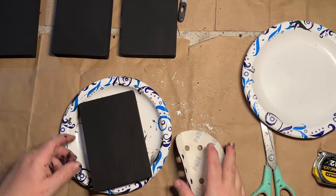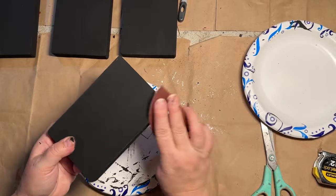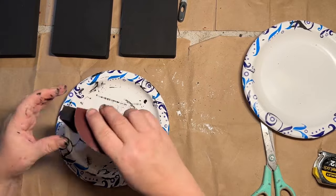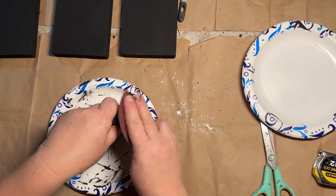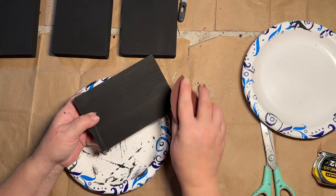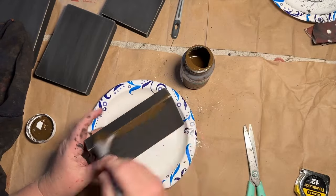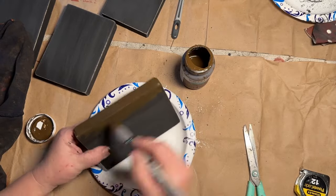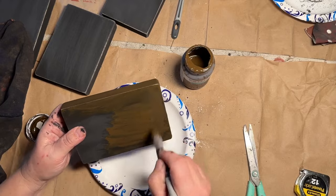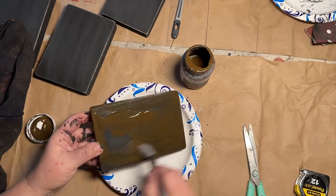I got all four of them painted and dried with the dryer. So now I'm just going to go along the edges and the corners — this is going to be the back. Just give that a little bit of a sand, and then where you can see the raw wood, what I'm going to do is take the antique wax and use it as a stain and go over it. It will also seal it in. Next I have the Waverly Antique Wax, and I'm just going to put that all over what I just painted and sanded. This is going to give it a nice seal coat and it's going to take those raw edges that I sanded down to the raw wood and stain them so they're a little bit brown and distressed looking.